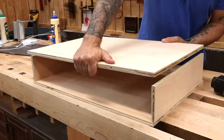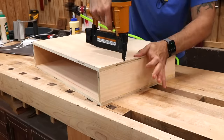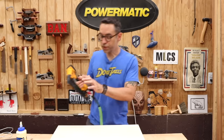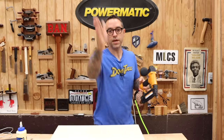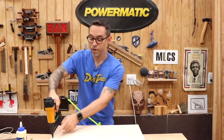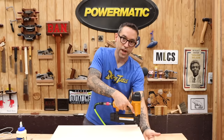So let's construct a box. Really nothing fancy here, just glue and brad nails. I'm using one-inch, 18-gauge brads. Now if you have a lot of experience with a brad nailer, you might notice that sometimes the nails just bloop, go out the side. There's a good way to avoid that. If you look really close at the brad nail itself, you're gonna see little tiny bevels on two sides. That bevel means it can slip in either one of those directions. But in the other orientation — perpendicular — it's usually going to fire true. So this is why I'm not firing this way, because the brad nails could blow out. I go this way. Now if it sways one way or the other, it's still within that half-inch piece and it won't sway out.